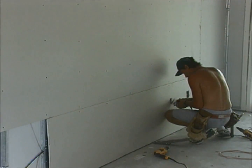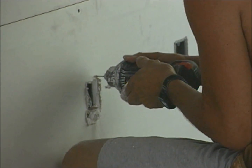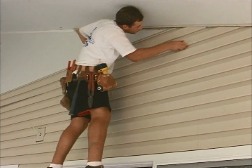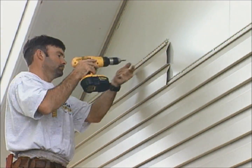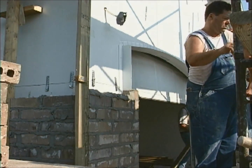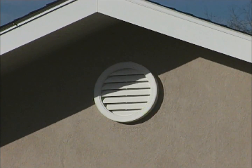After all the electrical wiring and plumbing is complete, drywall and other finishing materials are installed in the same fashion as a wood frame home. A number of exterior finishes can be applied directly to the snap and lock insulated panel. Vinyl siding is installed in a conventional manner utilizing number eight by nine-sixteenths wafer head screws. Brick veneer ties are anchored with screws directly through the steel skins. Conventional wire lath can be screwed to the panel, or a synthetic stucco can be applied directly to the steel skins.